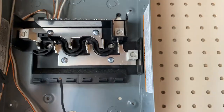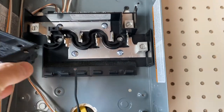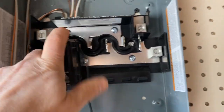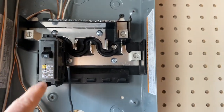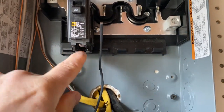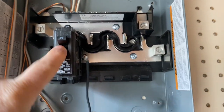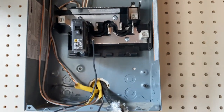Keep in mind I have no power going through — don't freak out. Don't be touching stuff inside these boxes if you're working on them. There's absolutely no power to this box and no wires going to it from any power source. When you do put the breakers in they just lock in there and push up and they're locked. If the switch is towards the outside of the breaker it's off; if it's towards the terminal in the middle it's turned on. That's all there is to it.